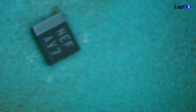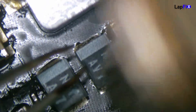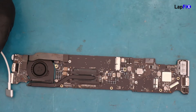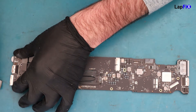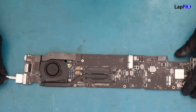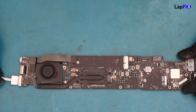Here's our new cap — this is the C7141. We're just going to do a replacement with this one. We did replace the C7141 bad cap with the replacement one. Let's go see if it works — and you can see a lovely fan spin, orange light, looks good, and the processor is getting warm. Everything looks to be good!